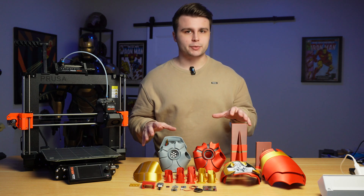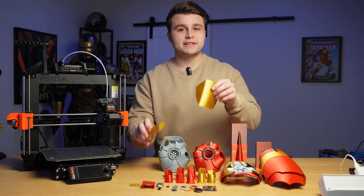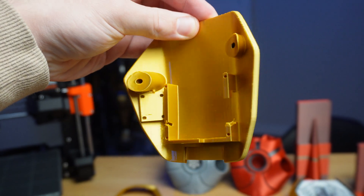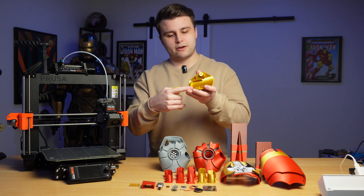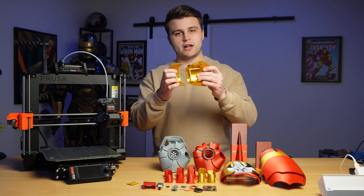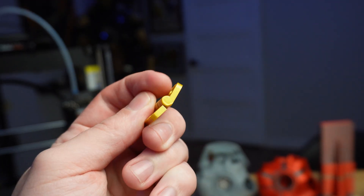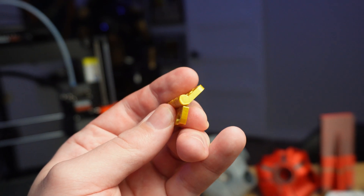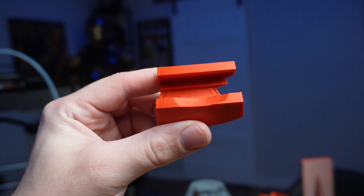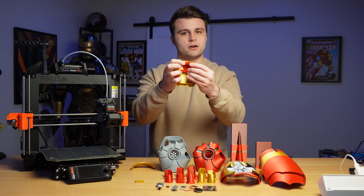So now let's dive into the 3D prints. They just look so good. First, we have these two pieces for the handguard. They've been extensively modified to fit all the electronics and the PCB design for this project — there's a cool little mount in the center for the PCB, two circular mounting points that attach directly onto the glove, and a nice little slot for the hinge. The hinge has actually been 3D printed in place. When you 3D print the hinge, make sure it moves perfectly freely — mine was pretty stiff so I really had to work it until it started moving freely again. And next up we have the LiPo holder — the LiPo just slides in from the side and we're going to glue this on the inside of the handguard.